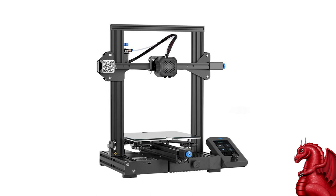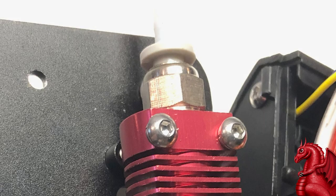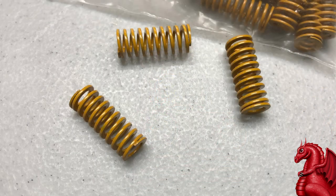I did three upgrades on mine — two I think you should absolutely do. First is the hot end coupler for the Bowden tube, which will run you about 50 cents. You can buy a pack with extra Bowden tubes; I'll link that in the description. It just screws in and takes a minute to replace, but it'll make things much more reliable. The second thing is the light load compression springs — flat springs that work much better than the stock ones. Spend a couple dollars, replace these springs, and you'll be much happier with your machine.